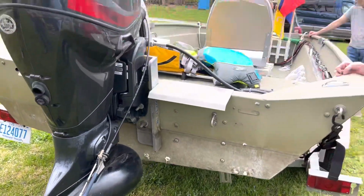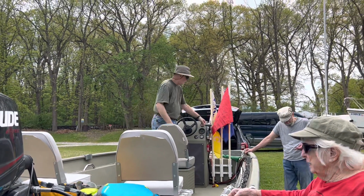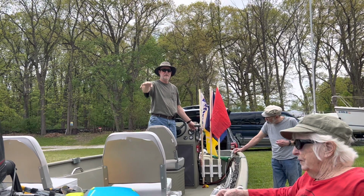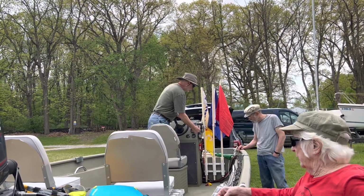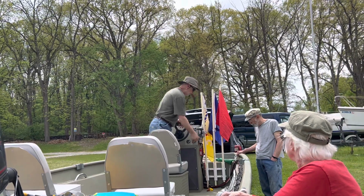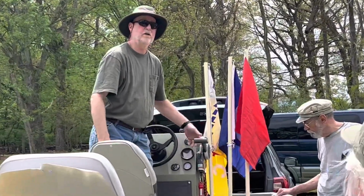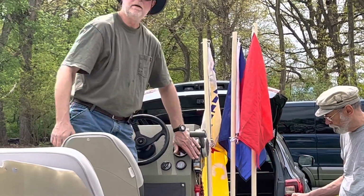And then one last thing, the cold throttle in neutral is this guy. Okay? You shouldn't have to use it. The engine just started right up when I ran it about a month ago. But if you do, there's no choke on this because this is fuel injected. Okay, there's no choke, so you don't have to push the key in to choke it or anything. But you might have to accelerate the engine to get it to start a little bit. This is your neutral throttle. It won't work in gear, nor will it allow you to go into gear. It blocks the throttle. Okay?